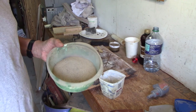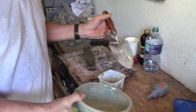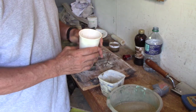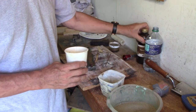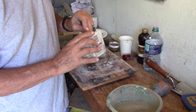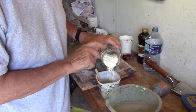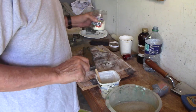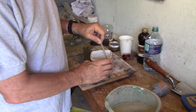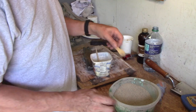What I have here is playground sand, just a little playground sand. And then I have a mixture here of molasses and water that I've mixed up — just regular old molasses from the grocery store. Pour a little of that in. Now I'm adding a little bit of just regular old flour. Pour a little bit, just a little bit. A little more sand — kind of go back and forth and you get a nice consistency.